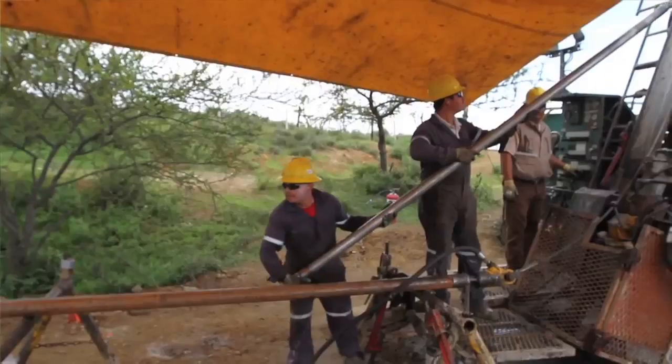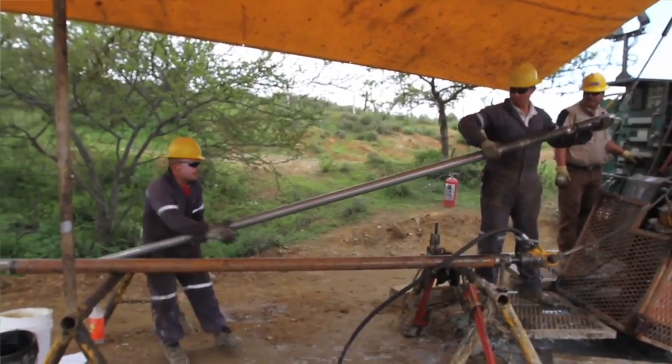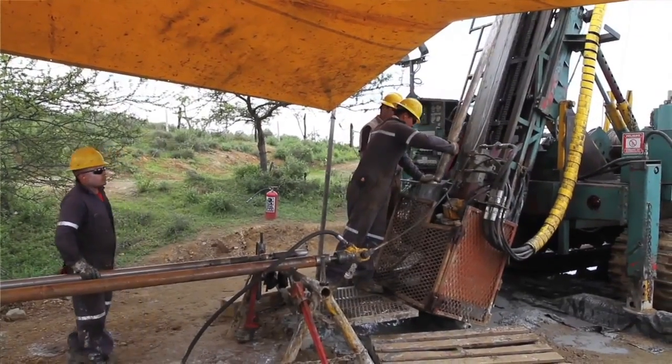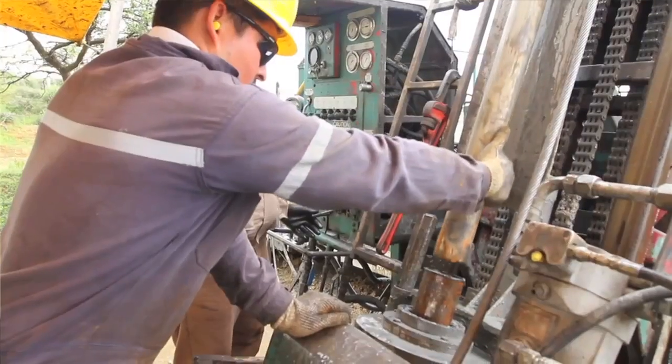As the drill progresses down through the rock, there's a natural tendency for the drill stem not to go completely straight. Because of how a drill bit and drill stem turn, you actually end up with a corkscrew going down. The deeper you go, and depending on the kind of rocks you're going through, that rod system will deviate. The smaller the rods, the more likely they are to bend. They all deflect to a certain extent — even a piece of a branch, if you push it up against something, it's going to curve.